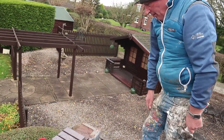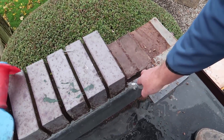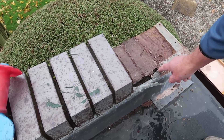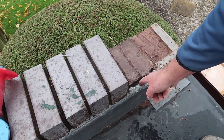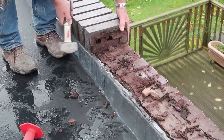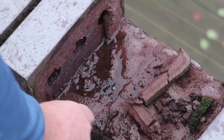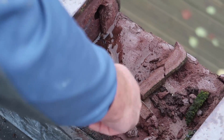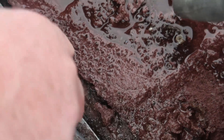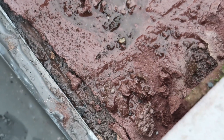Casey's just taking the first couple of bricks off - no wonder it's getting in. All that water's inside, so it's getting straight in there. It's sitting in, soaking through. What's happening is it's getting in there, going underneath that lead and that's where it's getting through to the inside - which is not good. So we've got some lead to go over that.